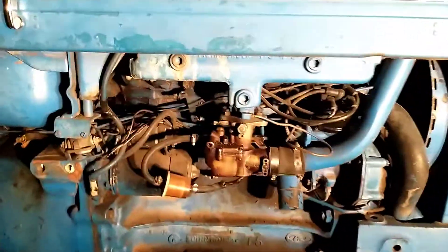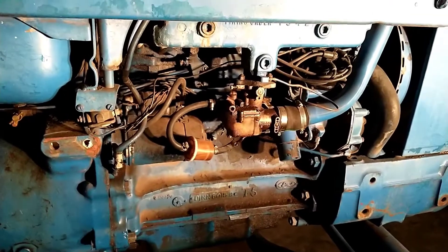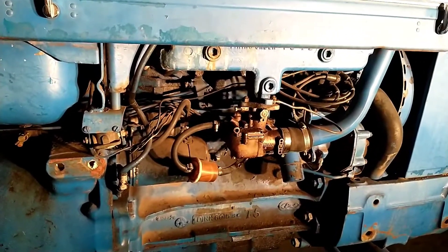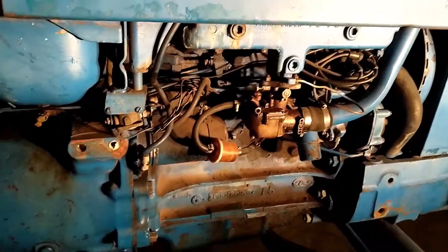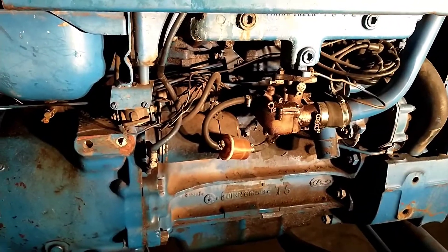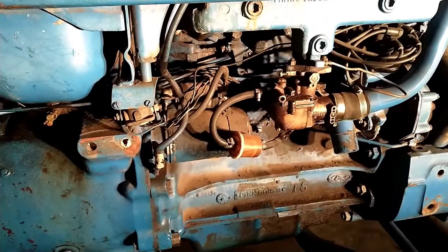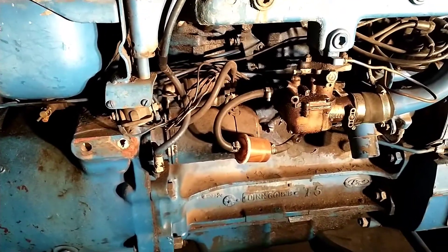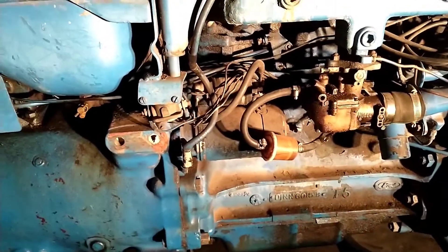We're going to start. There are several other things I want to do while I'm here. One of my pet peeves — I like to have nice new battery cables. On old equipment especially, there's not much more satisfying than an electrical system that works well. Another thing we're going to deal with is the starter circuit. This is a gas rig — you can see the carburetor there — but I believe what has happened is they put a diesel starter on it. The diesel and gas engines of this particular vintage Ford model are basically the same, with a lot of interchangeable parts, which actually includes the block. The flywheel I also believe is the same.